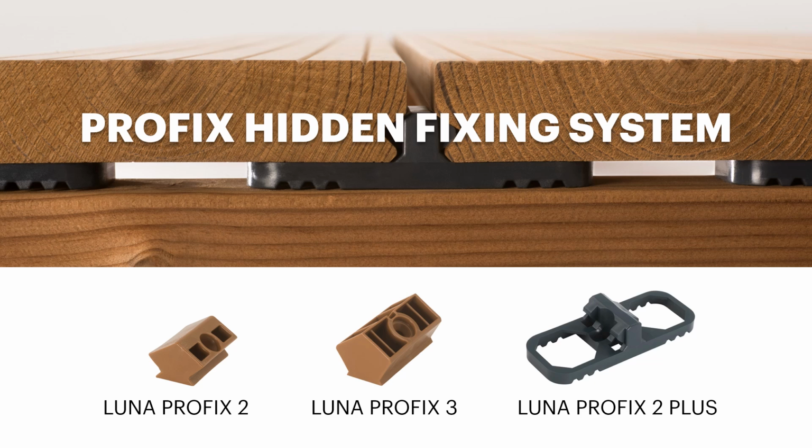Typical for our decking products is the V-shaped groove on the side of the product, which is the groove in which to place PROFIX hidden fixing clip. Lunawood's unique PROFIX hidden fixing clip enables quick and easy installation of the deck and creates a clean and elegant appearance without visible screws. With PROFIX hidden fixing, you get consistent 6 mm gap between the boards.